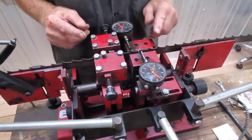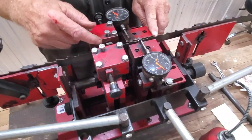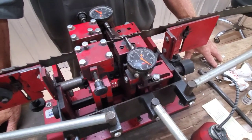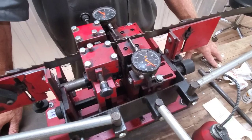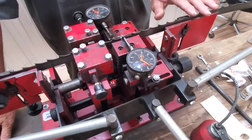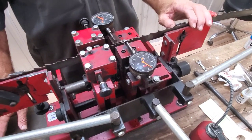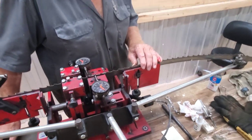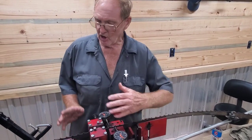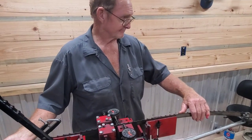Always back to where it's not touching so you're not influencing your dial. Start from zero on every blade if you want a true set blade. You never know when you run into a dog on your sawmill, a piece of concrete in a limb — trust me, that does happen. He's had blades come in where all the teeth are leaning one direction. One recently looked like they were at 45 degrees every single tip — completely bent over in one direction.